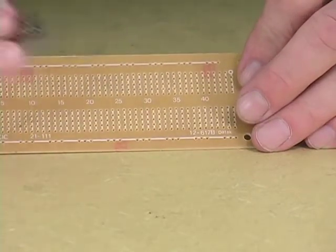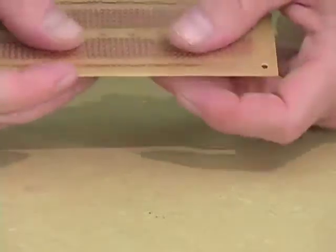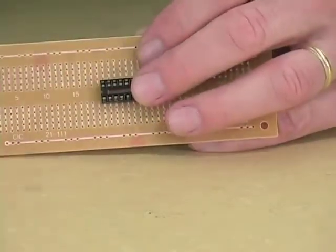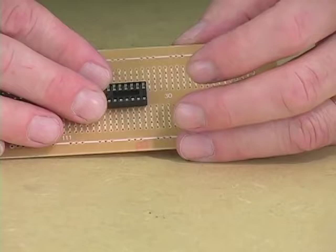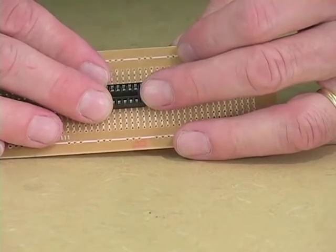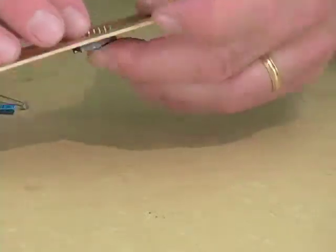You put the socket down on the circuit board on the non-copper side, put the pins through, and they come through on the other side. The socket is like a little tiny version of a breadboard — it only holds the chip. The reason you use this is that chips can be damaged by the excessive heat of soldering, and if they are damaged, they're very difficult to remove from the board with all their legs. So you need to attach this to the circuit board as your first step.